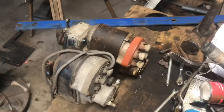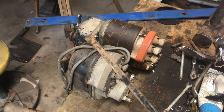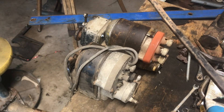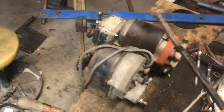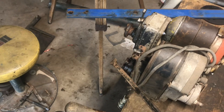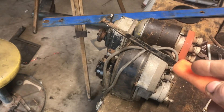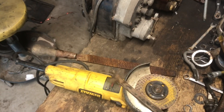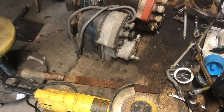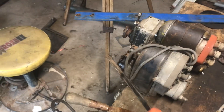Good morning. My task at hand is going to be to make a coupler so this magneto can bolt in place where that magneto fit on the 60. I need to make a coupler so that this drive will match up to the driving flange that one matched to on the 60. I intend to make that coupler out of a piece of strap using my milling machine, which consists of a side grinder and a file.